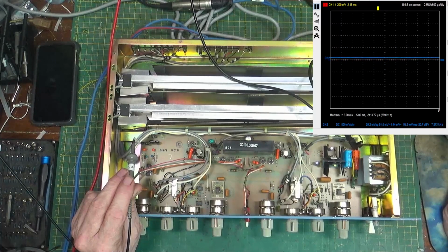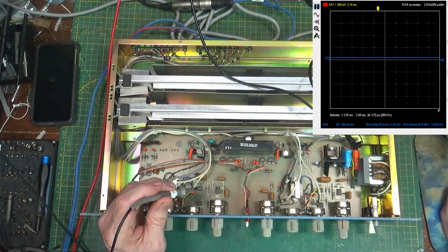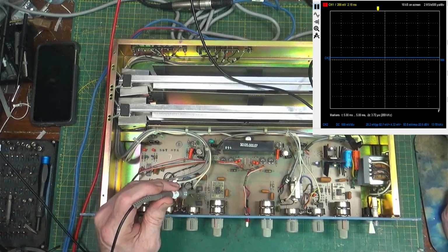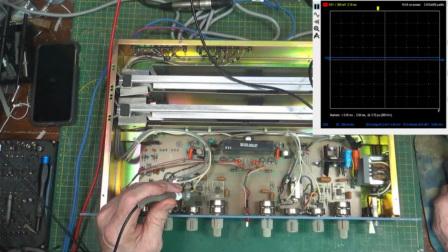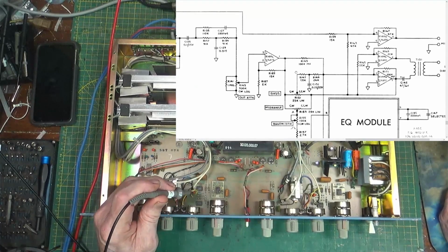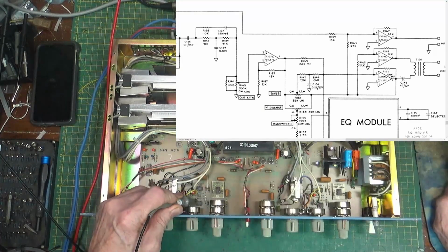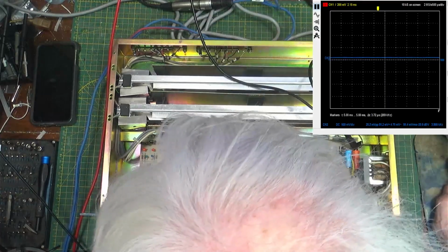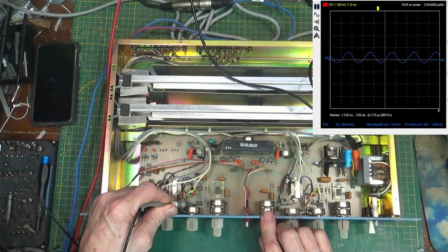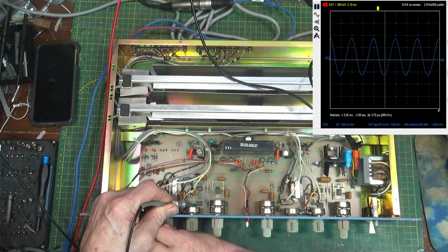It goes down through this output attenuator over to IC 107, I believe that was one of these down here, wasn't it? Yeah, it's this one down here. So if we look at 107, let's take a look at the output of 107 and see what that looks like. That's on pin 1. And go up here, bring the scope back up. Yeah, we got output. Now this is post output attenuation, and that would be this knob. So, yep, there we go. That's varying. That looks good.